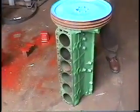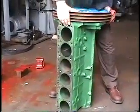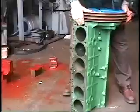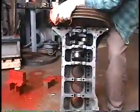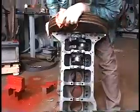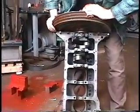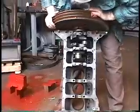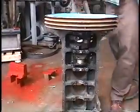Well, here's our good old Chevy engine block, all cleaned up. At least one bore looks good. And what we've done is shorten the crank, so we only have the throws we need, and in this case, 3 main bearings. And we put Zerk fittings on everything so we can grease it occasionally.